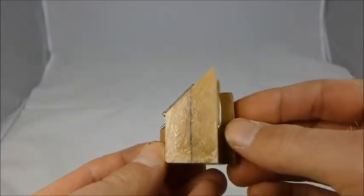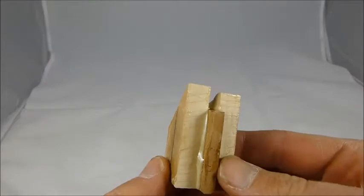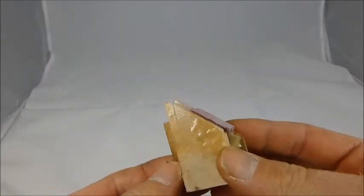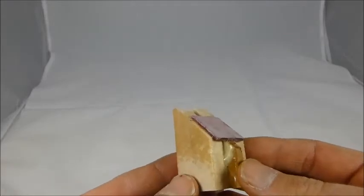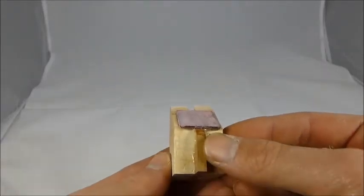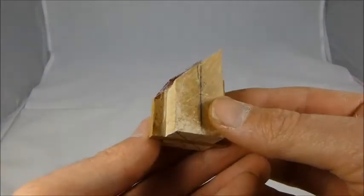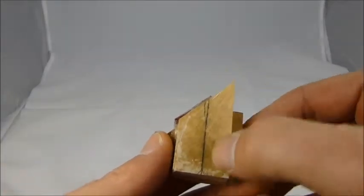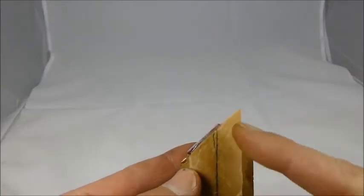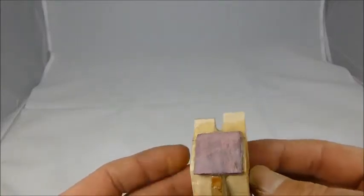That's a pencil mark, but most of you guys are kind of interested in the segmented pen, so this is about 15-20% of the way through the process. Bird's eye maple, centerpiece is cherry. Bird's eye maple, the black pencil mark helps me find center, so I know where to overlay the 45-degree cut.